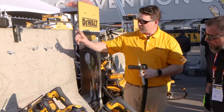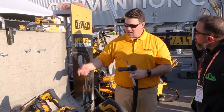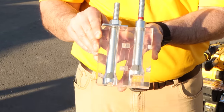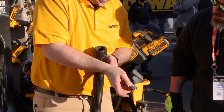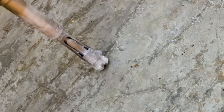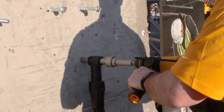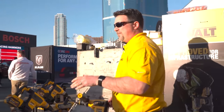Now what we're going to do is take a separate drill bit called an undercut bit, also hollow, so it'll collect the dust, and we're gonna carve out the bottom of the hole into basically an upside down V. When the anchor sets, this sleeve, we'll hammer it down with a setting tool, and these splines expand over the cone into this upside down V we carve in the bottom. So we undercut and we evacuated the hole all in one step.